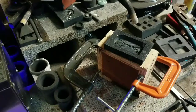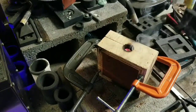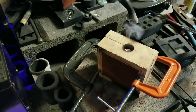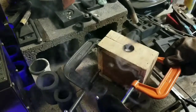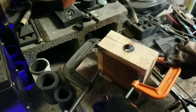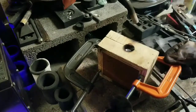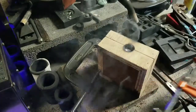So this is going to have kind of a larger sprue. And the pour point was the back of the duck instead of the underside or the side of the duck. Let's see how this thing came out. I'm a little bit curious if this gravity feed helped at all. It may have, it may not have. She's still smoking. I've been watching a lot of videos on sand casting, petrobond, and delft clay, and all that rigamarole.